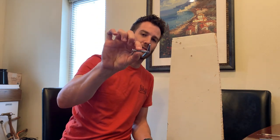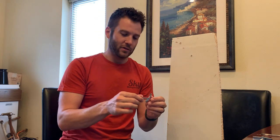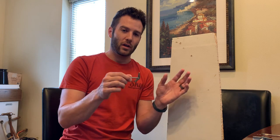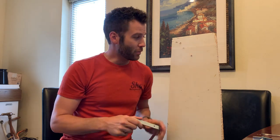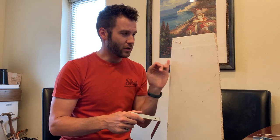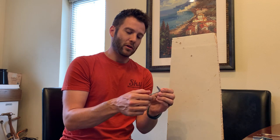So what we like to use — we call them spring anchors, they're actually called toggle bolts or butterfly anchors. They look a lot like this and they come in several different sizes and lengths. The nice part about these is whenever they go into the wall, they don't come out. Now ultimately your best bet is to find a stud in the wall and put a screw directly into the wood, but a lot of times that's not a possibility because you've got a lot of sheetrock and very few studs, so this has been the best way we've come up with to permanently fix the problem.